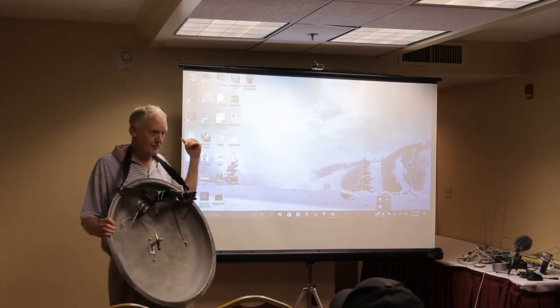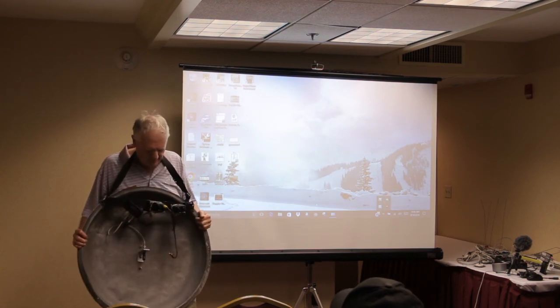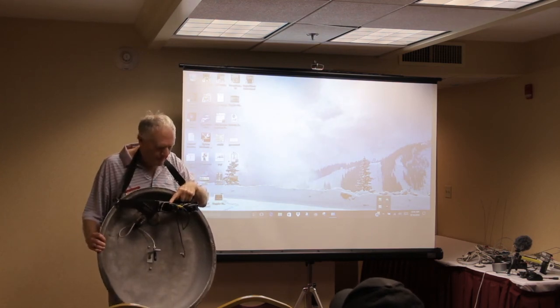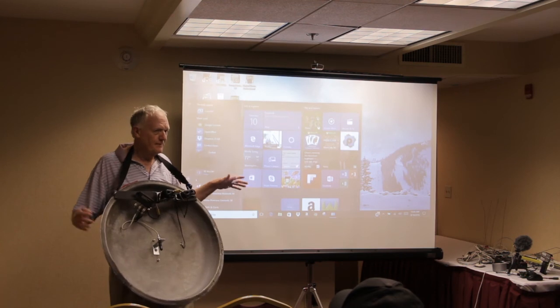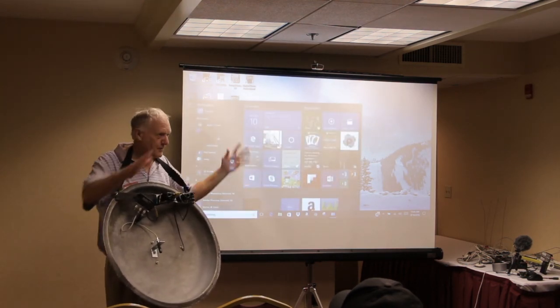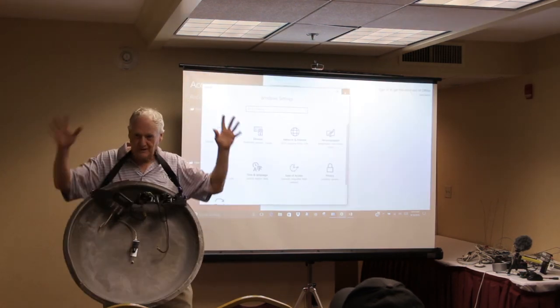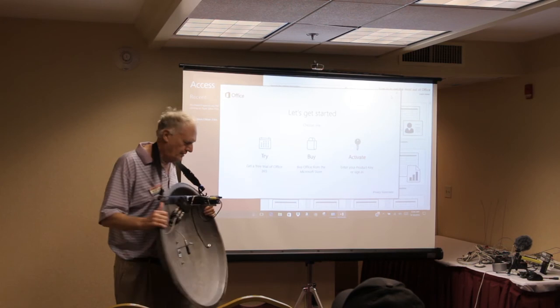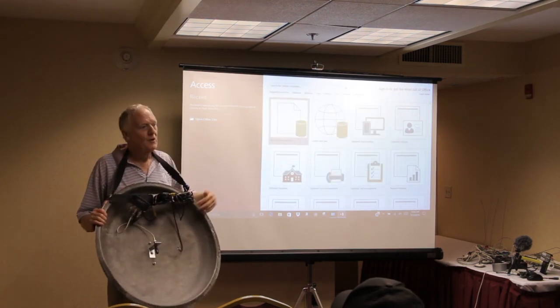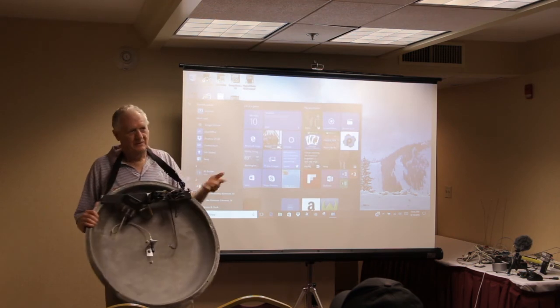Now, the box is out here, you can do that, if you put it in the parking lot. And this is the third harmonic, so once you're within 10 feet, third harmonic's great. The reason is, because you're in the woods, and there's all the trees and the rocks and granite and everything else, so you really do need the third harmonic at that point. Or in an apartment building, that would also be useful.